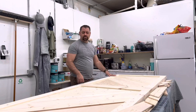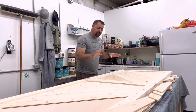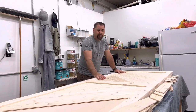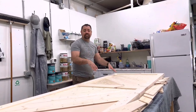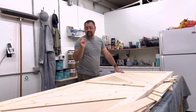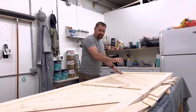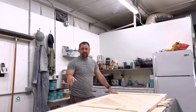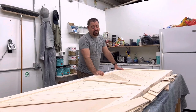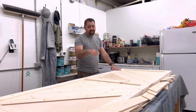I also measure for where the straps go in relation to the top edge — they come down about six and a half to seven inches on this door. This is the door we're building, and on our next video I'll show you how it looks when it's all stained, sealed, and hanging in that space. The installation will take about two minutes — we just come back and pop it in place. You install the track in the client's space in about four hours or less, then come back about a week later with your finished door. Don't try to build the door and figure out all that math at the same time — this is the way to do it.